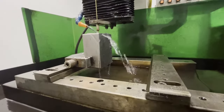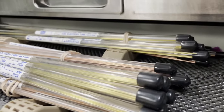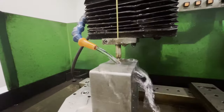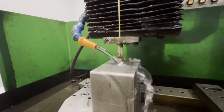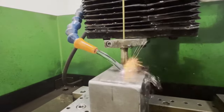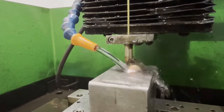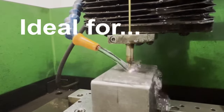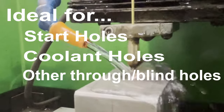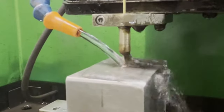The third type of EDM is EDM drilling, also known as hole pop EDM. A small diameter electrode is used to erode a round hole using electricity and deionized water. The deionized water is forced through the hollow round electrode as well as externally to flush the molten metal away, cool the workpiece, and provide a medium to propagate the spark. This is ideal for start holes, coolant holes, or other types of through or blind holes.